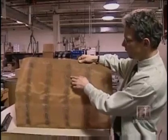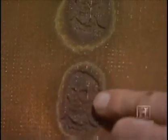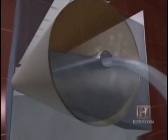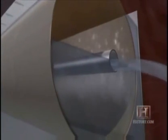You can see here are embossed three-dimensional structures in the wire. This is Abe Lincoln, the subject of the watermark for the $5 bill. The wire mesh is wrapped into the shape of a cylinder that then rotates partially submerged in a tank. The tank holds the paper, now liquefied into a slurry of 96% water. As the wire mesh turns, the pattern of the watermark subtly rearranges the fibers collecting on its surface.